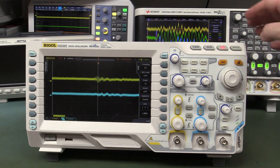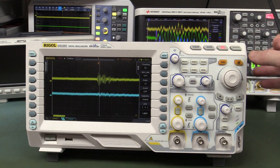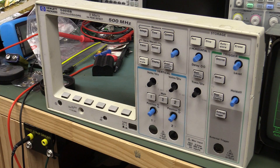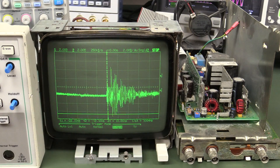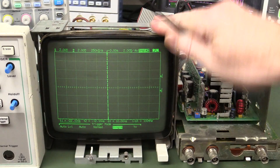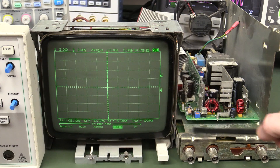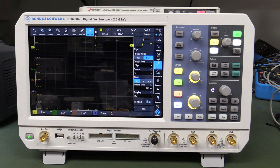Low frequency stuff - not great. Really just a gentle tap like that is quite susceptible - that's the most susceptible for BNC coupling, I suspect. And the Rigol 2000 series - susceptible to both low and high frequency, about average. Tap the BNC and yes, very much so. And old school - let's get the HP 54616B. Giving it a good whack on the chassis - that's fine and dandy. The metal shielding for the front end means you really have to tap the BNC directly to get any coupling to the front-end coupling cap.